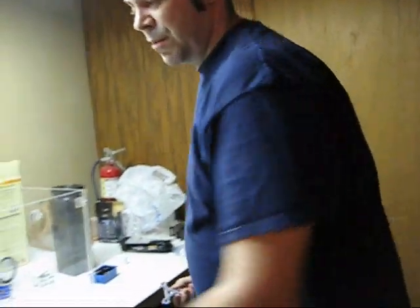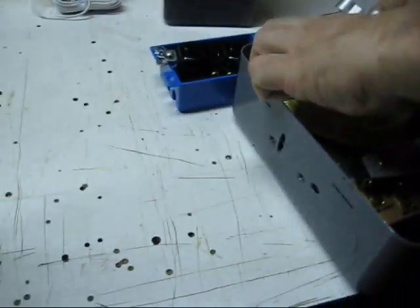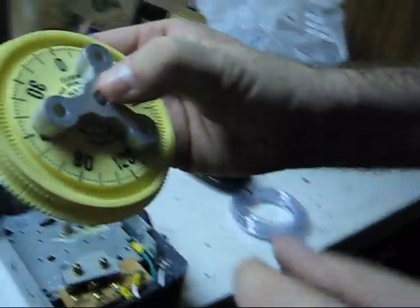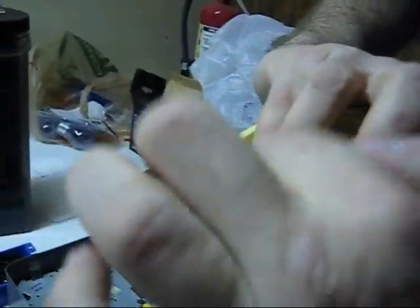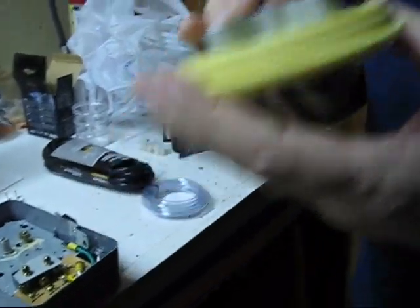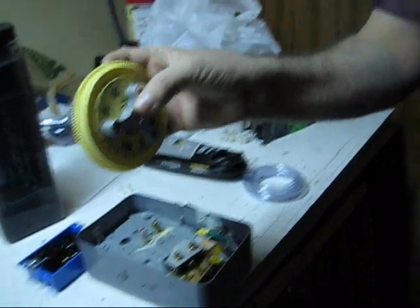The most important thing: how are you going to attach the rod to the timer? This is a piece off a rod holder that my dad found. This right here will be bolted - we put the drill holes where this goes and on the back you put your screw through here and it bolts there. The most important thing when doing this is if these gears are damaged at all, this timer is junk. We've measured it and it's fine. The rod will be threaded and connect to this, then go to the egg sac chamber and turn it.